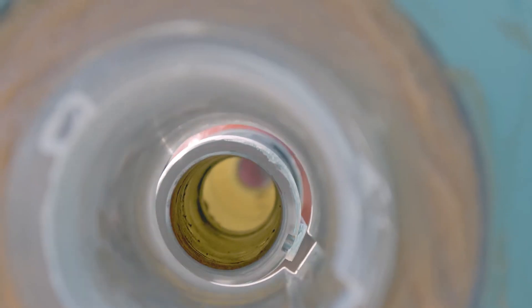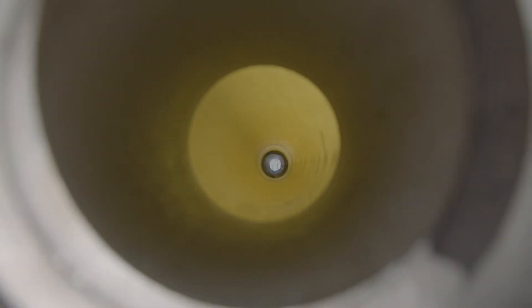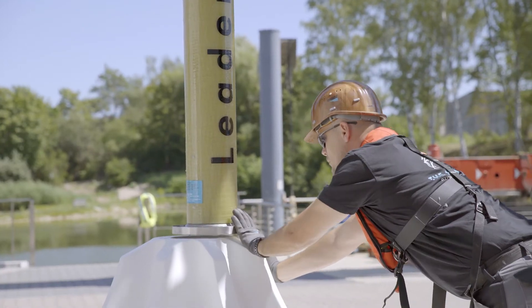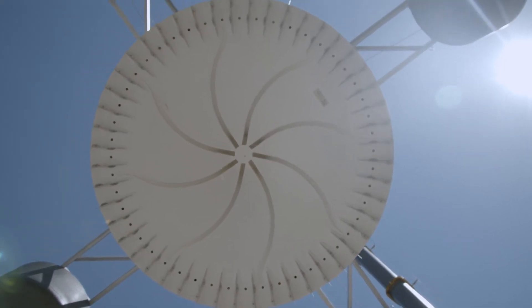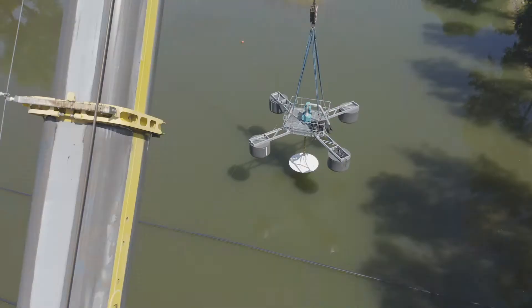The process air is fed directly into the mixer body through our specially designed shaft. It is made of light yet strong fiber reinforced plastic. No other tubes or pipes are necessary. At the mixer body itself, the air is dispersed by shear fins throughout the circumference of the mixer, introducing oxygen at the bottom of the lagoon and distributing it 360 degrees consistently.